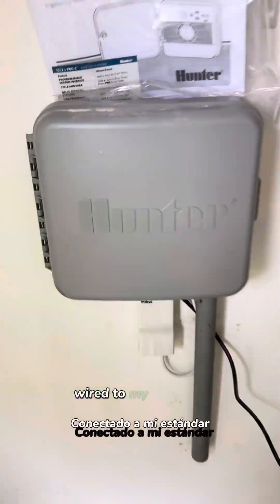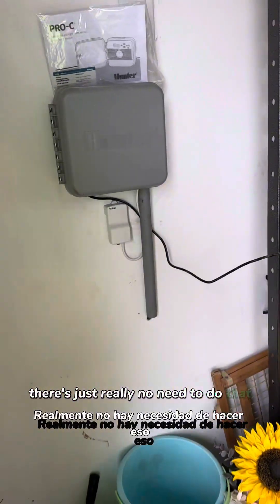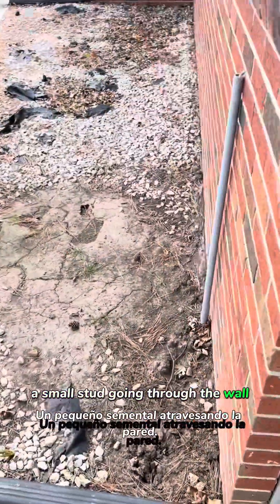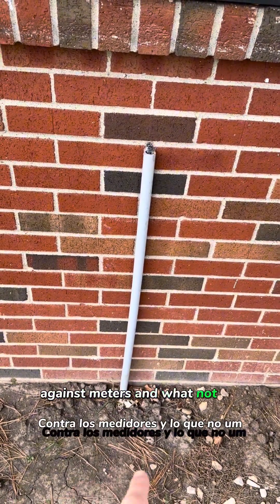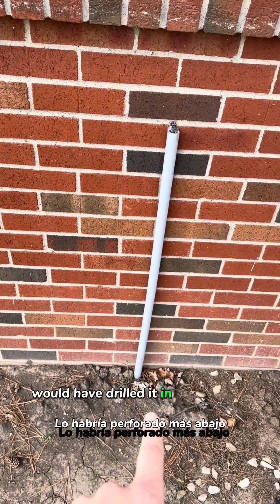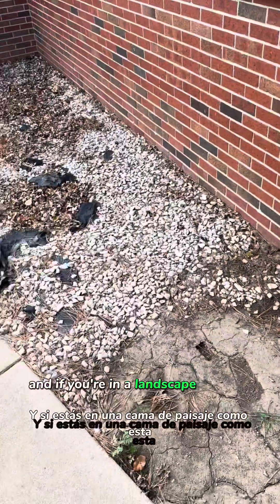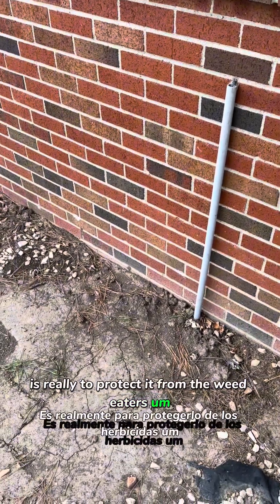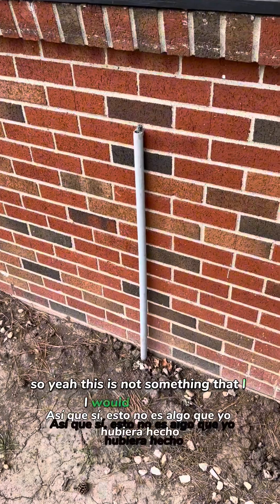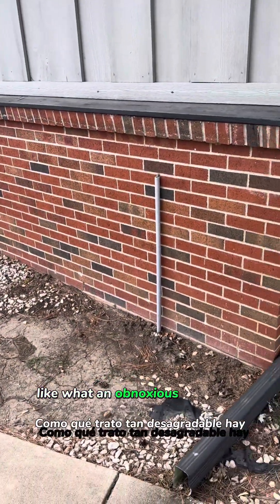This box was not wired to my standard. Another thing I wouldn't do is put PVC pipe right here — there's really no need to do that. And if you are going to do that, finish it with a proper elbow and a small stud going through the wall. Out here, I don't mind having the sleeve up on the wall to protect against weed eaters, but a real professional would have drilled it lower, sealed it, and maybe done a small PVC piece about this tall. And if you're in a landscape bed like this, I wouldn't have done PVC at all, because the only reason for the PVC is really to protect it from weed eaters. Nobody wants to see that nasty setup in the front of their house — what an obnoxious deal.